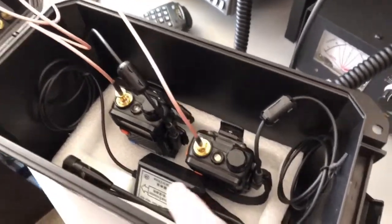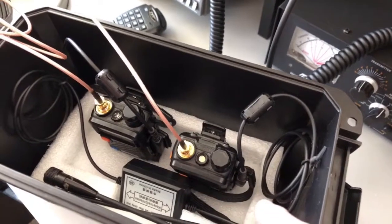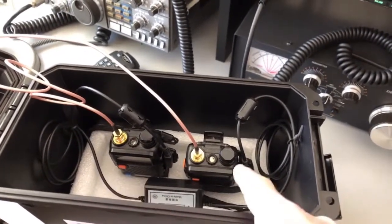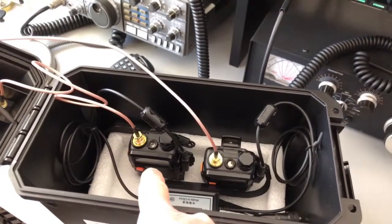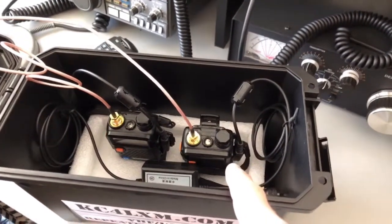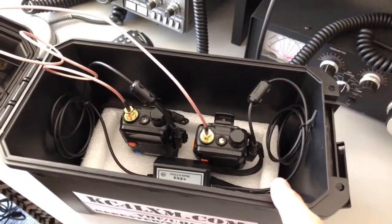Everything else is just plug and play. Here is the repeater controller, purchased off Amazon — you can get them off eBay as well. They just plug into the mic and speaker ports on the radios, and then you program or set up the radios. In this case this one's receiving and this one's transmitting — so this is the input and then the output. Currently I have it set at one watt, but you can set it at high power and go to four watts on these radios. You can also use similar radios that may have up to eight watts of power.